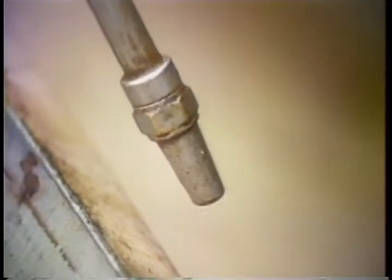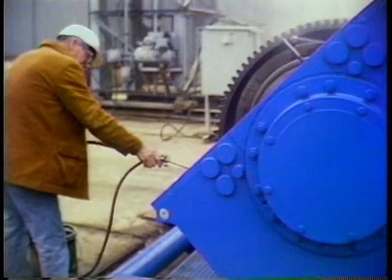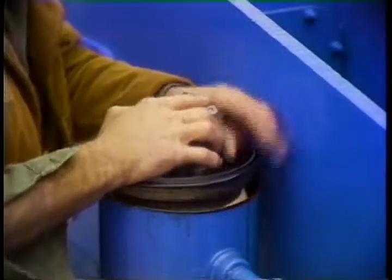While you're waiting, hose out the mud trap with high pressure diesel. Then drain the crankcase. Use a diesel spray to loosen any sludge buildup in the bottom of the pump — pay special attention to troughs and ledges. Now get a bucket of diesel and some rags and clean the pump. Be sure to clean the oil pump suction strainer in the bottom of the crankcase. Take some time here to make sure the pump is very clean. Mop all the diesel dry — diesel fuel is a contaminant you don't want in the lubricant. Don't leave anything inside the pump. Rags left in the crankcase can and do clog the lubrication system. Let the solvent evaporate while you check the bolting on the pump. Make sure everything's tight. Clean the magnetic filter once more and install a new element in the cartridge type filter. Don't forget to clean the filter case.